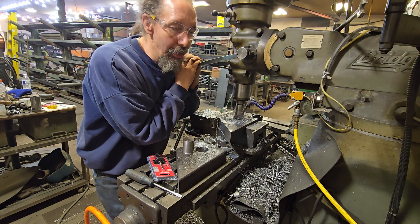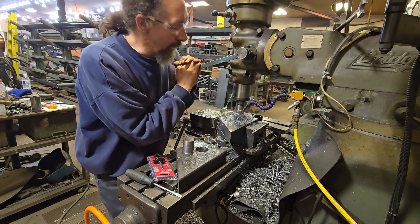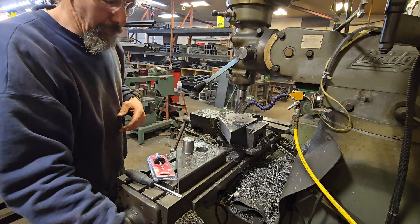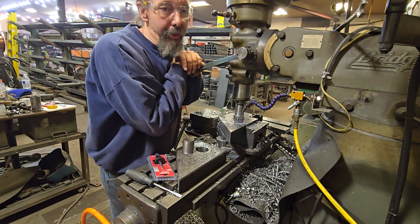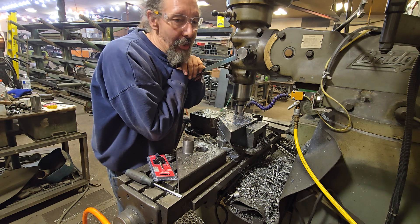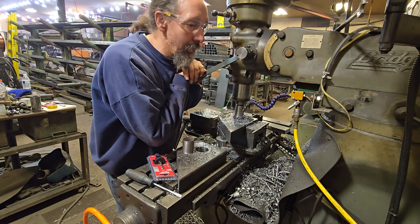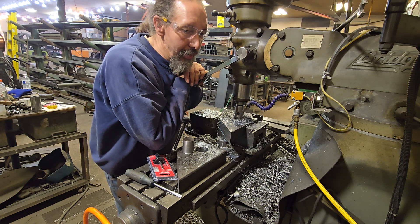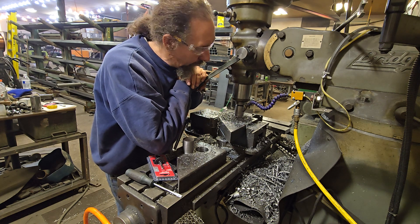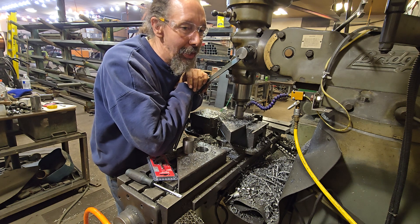I can start to feel that I'm hitting the crust of the other side right now, so I'm about to break through. I like to clear the hole — I'll come just until it's about to break through and clear the hole again. Because if I break through with a bunch of debris in there, my slug can stick inside of the tool. These tools have a hole through the back and typically come with a push rod to knock the slug out. But if you clear the hole right before breakthrough and then are very soft on your push, the slug will just about drop out on its own.